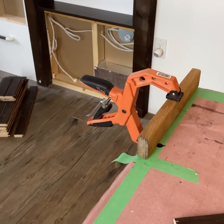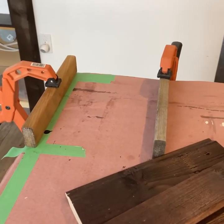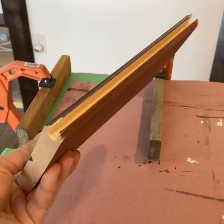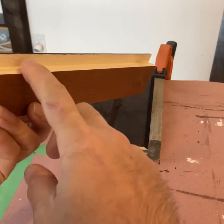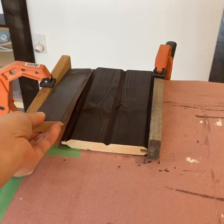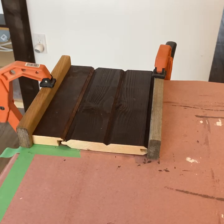When installing, I like to start with a groove side against the wall, and I've set up a little demo to show why. First piece is snug against the wall, groove facing the wall. For the last piece I install, I'll cut out the bottom of the groove. That way it fits snug against the opposite wall and drops right in. It's easy and looks professional.